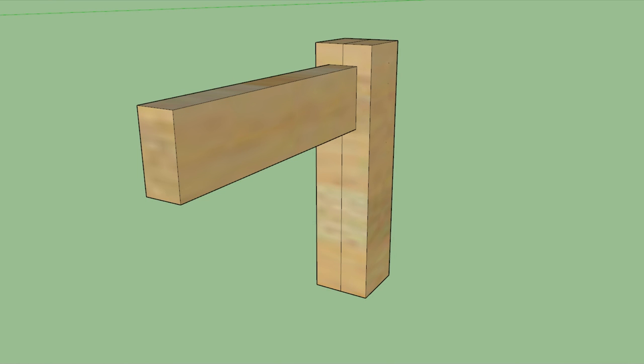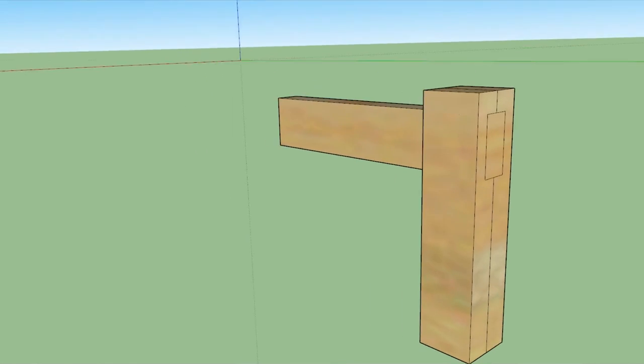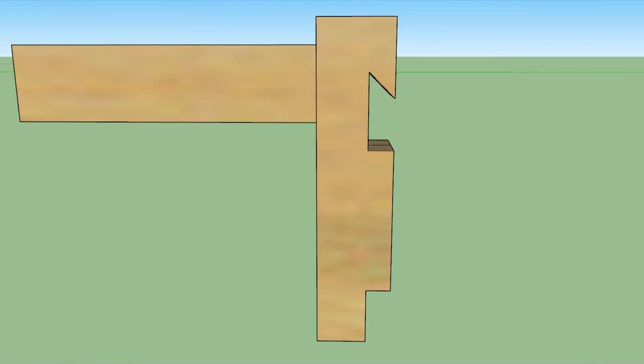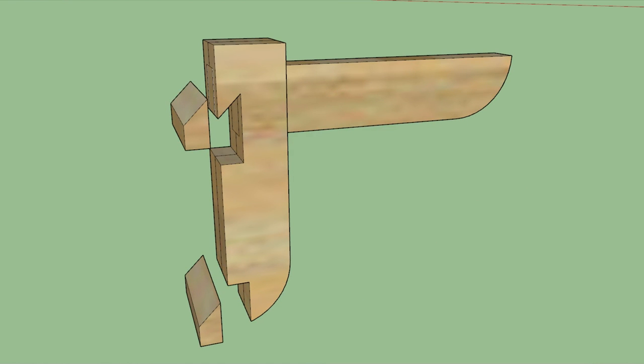Knowing that one of the strongest joints you can make is a mortise and tenon, I designed this in SketchUp. I figured it was a good idea to have multiple grain directions for added strength, and I can accomplish both with just three pieces of 2x4. When it comes to hanging it on the cleat, I can make my cutout through all three pieces — I just need to make sure the tip of the cutout is at least an inch or so lower than the top of the horizontal outrigging piece. Then to make it more aerodynamic and stylish, I can round over the sharp corners — plus it hurts less when I bump my head into it. I'll make about 10 of these brackets and put them wherever I need to on the wall of cleats positioned 9 inches apart. Let's see if it'll work.